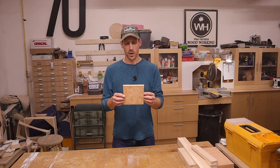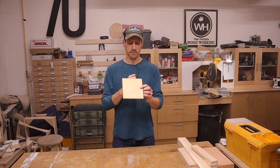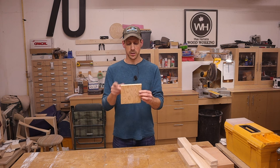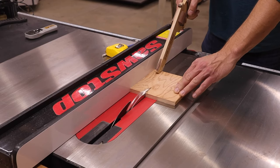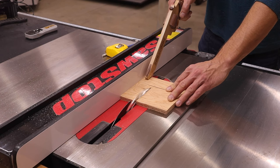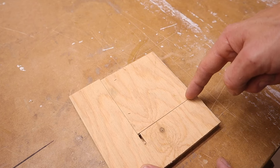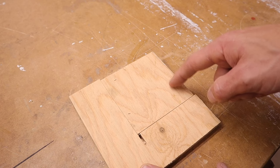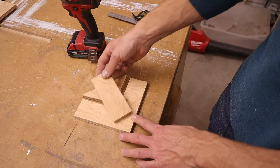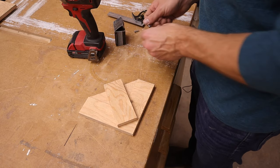In that video it looked like he was using particle board — I'm not going to use that. I'm going to use some half-inch plywood; three-quarter inch would probably be better, gives a little bit more surface area up against your material, but this is what I got. So I'm going to cut this into an L shape on the table saw. Then I'll cut the piece on a 45 on the band saw — I think that's the safest way. Next we need to attach this piece of wood and leave it proud so we can wrap the elastics around it. I'm just going to use a couple three-quarter inch screws.